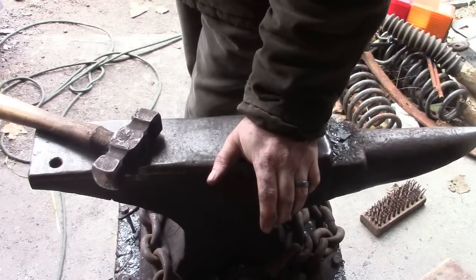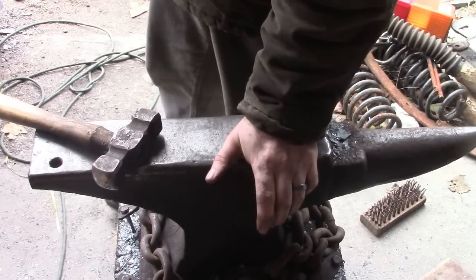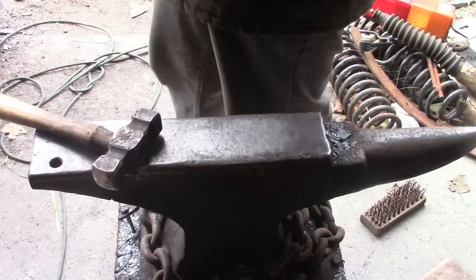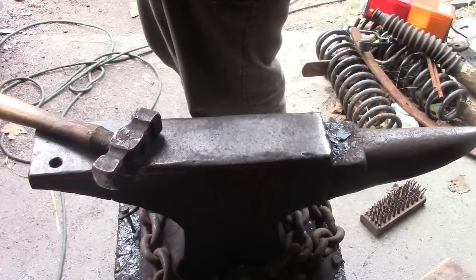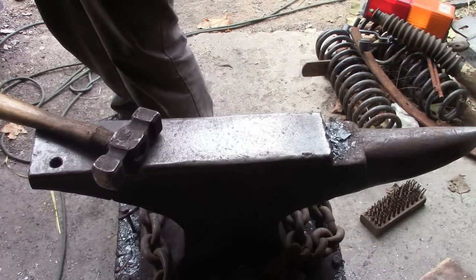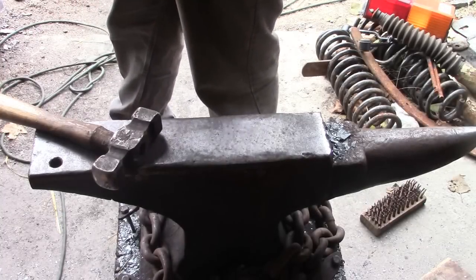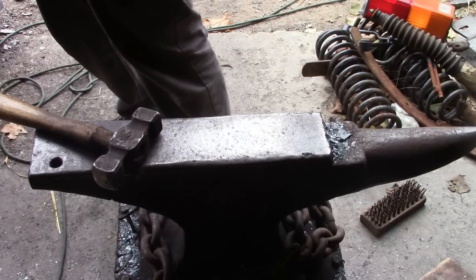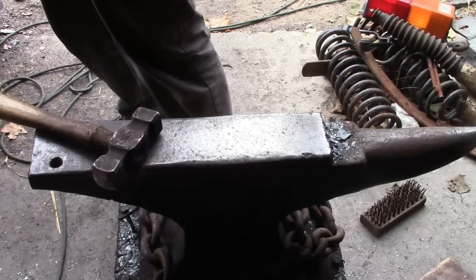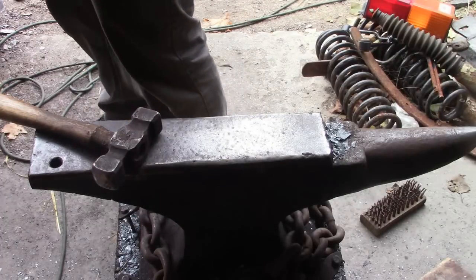One other thing, since this is the final weld for the knife, we're going to forge the knife right after we're done forge welding these together, I'm probably going to do 5 welding heats. At least 4, maybe 5. You want this one to be as solid as everything you've ever done, because if you have a little flaw in one of those early welds, by the time you get done folding it, it's going to be so tiny that when you get to grinding it, if you run into it, it'll grind right out. You run into a flaw here, and that could run from one side of your knife all the way through to the other side of your knife, and you're never going to grind it out.